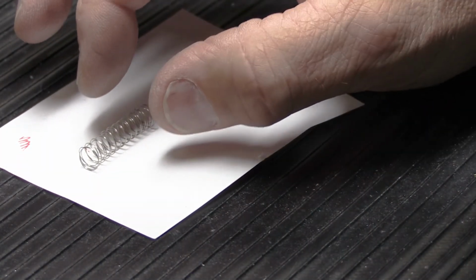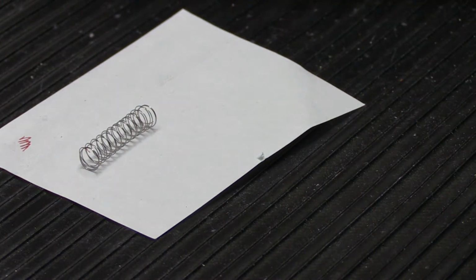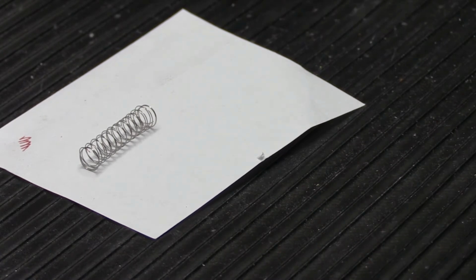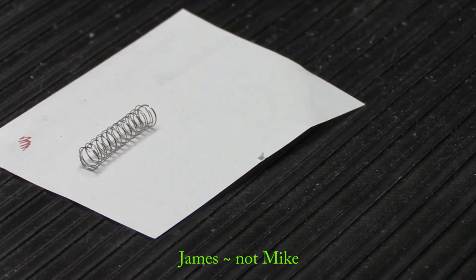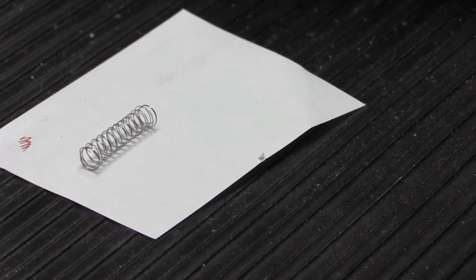If you put it in the Chime solenoid tube just as it is now, you still have to worry about them possibly unwinding each other inside the Chime. Once you put this all back together and we test it here at the shop, we're going to ring it 6, 8, 10 times, and then it's going to work fine. And then we're going to send it back to Mike, and he's going to install it in his house. And over the next 30 years that he might live there, door chimes last 30, 40, 50, 60 years. It's got to work right all those times.